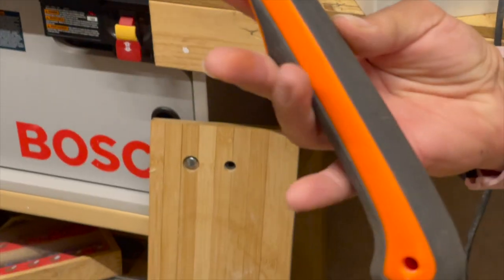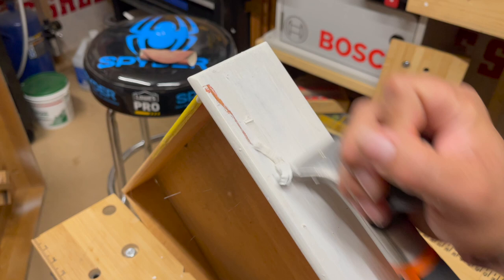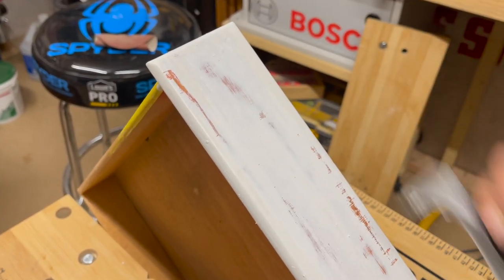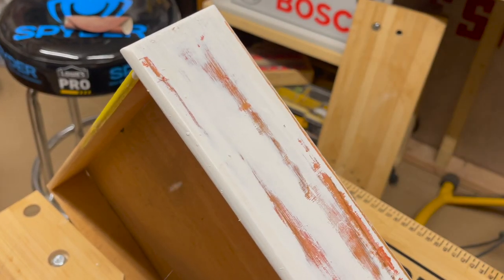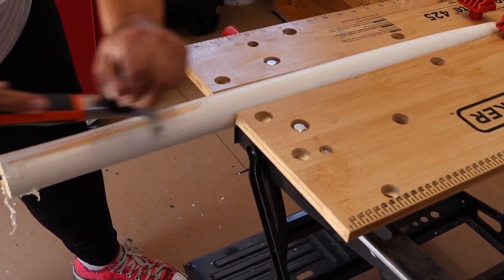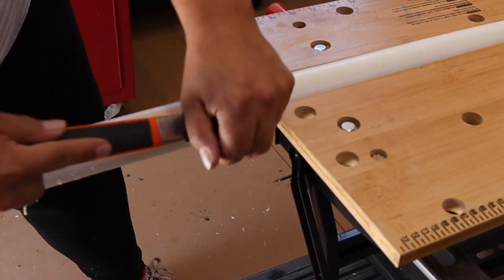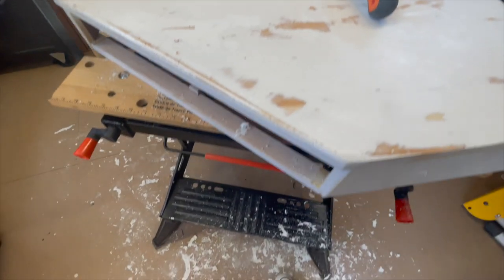One of the most eco-friendly ways to remove a thick painted finish without a stripper is just scraping it. There is just so much controversy nowadays amongst chemical strippers, and it would be an added step to have to remove it and dispose of that product. By scraping a finish, you can remove several layers of paint really quickly and just toss it in the trash. I always end up finishing up with sandpaper, and scraping a finish beforehand really reduces the amount of sandpaper you'll end up using, which is also eco-friendly.